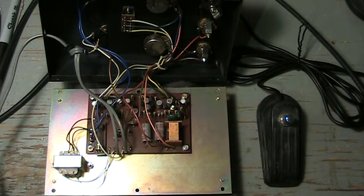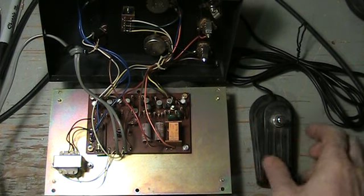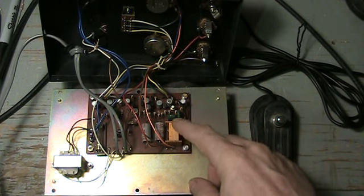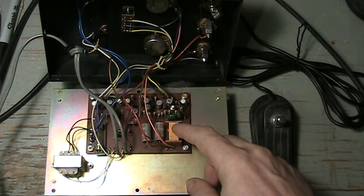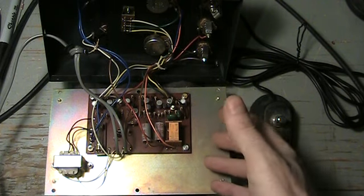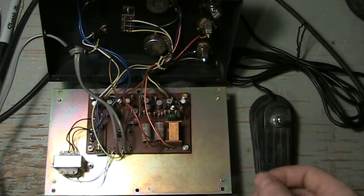Before, the pedal would work with the fuzz tone, and then when you press this button here, the foot switch, to bypass the pedal, this has actually true bypass. The contacts in the old relay were so corroded that none of the guitar signal would get through. So, let's see what happens.